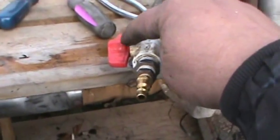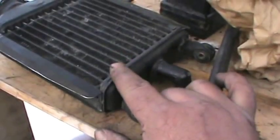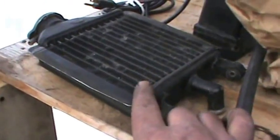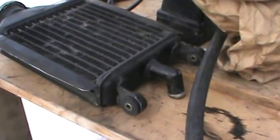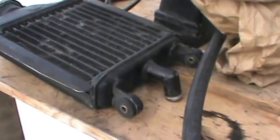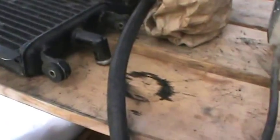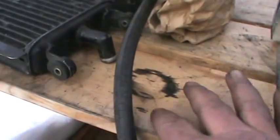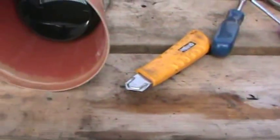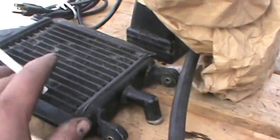I'm going to put this valve on the inlet line so I can squeeze it a little bit and increase the temperature of the water. There will be a lot less resistance in this, so the pump will just want to fire the water right through it — that's not going to give the water in the stove a chance to get really hot, even though there are two copper coil exchangers in there. So I can squeeze it back with this, hold the water in the stove a little longer, and let the blower extract as much heat as I can off this small radiator.